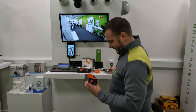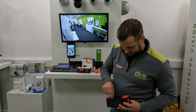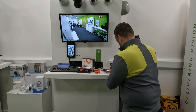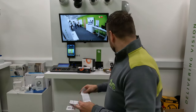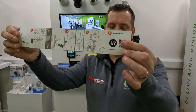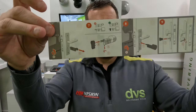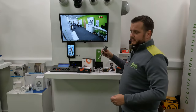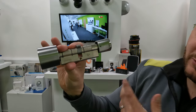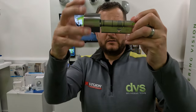You have the lock itself, a centre-pin screw, and a little allen key screwdriver. With the fitting instructions, scan the QR code and it brings up the fitting instruction video; scan the other QR code and it downloads the free app. Now, the biggest mistake most people make on this lock — it does have the SKG rating, so it's SKG rated and verified. There's the centre pin: when this sits in the door, that centre pin goes through there to hold the lock in place. You can see the rotating barrel.